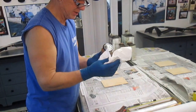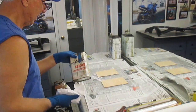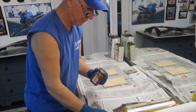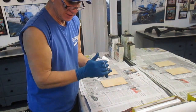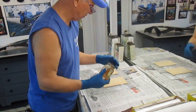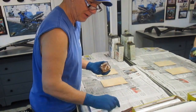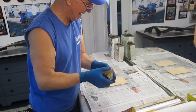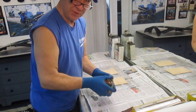This is a little jar of West resin I've mixed up. You can use the slow hardener or the fast hardener. West is actually an acronym for putting fiberglass on wood — that's how this resin was developed. I've put the hardener in at a five-to-one ratio by weight or volume. It's not critical at all — not critical to temperature or shop conditions — which makes it really nice if this is your first carbon fiber project.